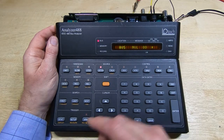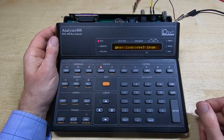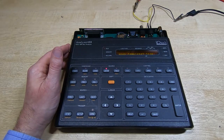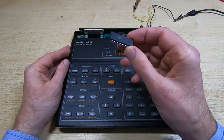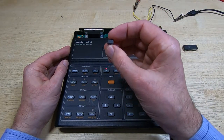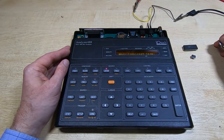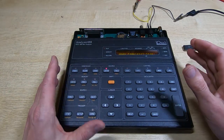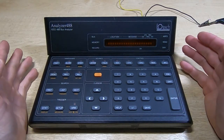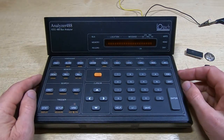That is now fully functional - it works the way it should. Since I repaired it I have fully tested this and it works exactly as it should. What it required was three SRAM chips - I suspect it only needed one but I replaced all three anyway - a replacement DS-1210, in our case one that we've made ourselves, and of course the replacement backup battery. Quite a low-cost repair and quite an interesting one. I'll get this reassembled so you can see how it looks in one piece. The display tilts up as you can see, you can set it to whatever angle you want, and it folds flat when you're not using it.